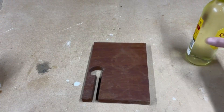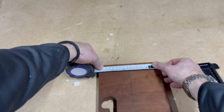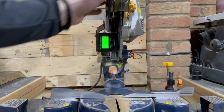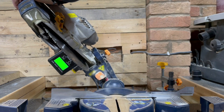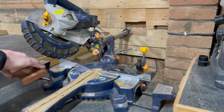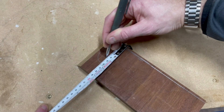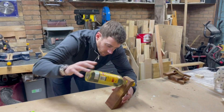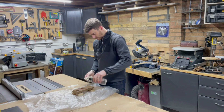I had some wood left over from making the charcuterie board so I decided to make a wine bottle holder with it. I marked out a rough width using the wine bottle, then measured it properly, lined up my table saw and ripped it to width. Then I adjusted the mitre saw to 55 degrees according to my digital angle finder — the angle depends on the length of your board and I kind of just eyeballed it. I'll leave a link to this digital angle finder in the description. I cut the angle on one end, flipped the board over and cut the angle in the opposite direction on the other end. Then I marked out where I wanted my hole, found the centre and drilled it with a 35 millimetre forstner bit — I really need some new forstner bits as this took me about five minutes to drill the hole. Once drilled I tested the bottle and it balanced great, so I sanded it up to 220 grit and smothered it in white mineral oil to finish it off.